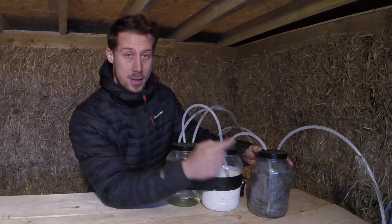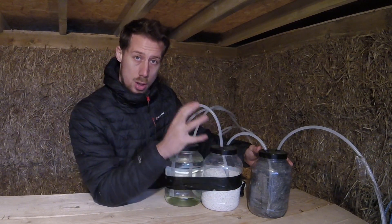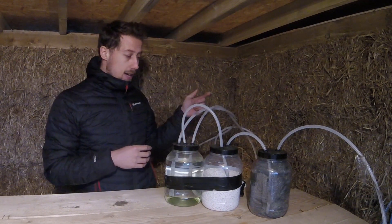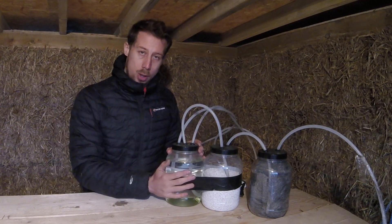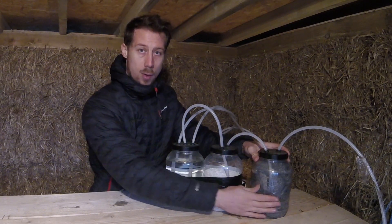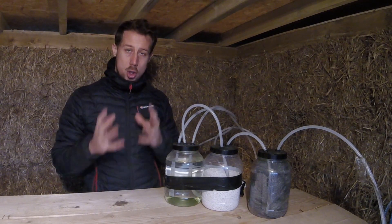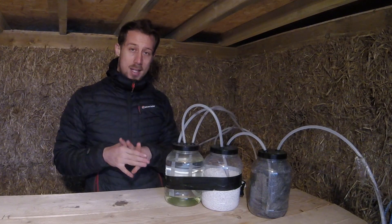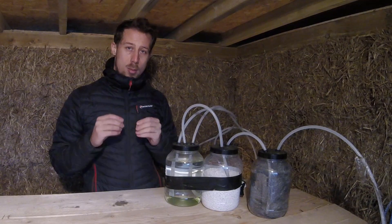And then lastly we have the wire wool or steel wool — that's what reacts with the hydrogen sulfide to remove it. So after the gas comes through these two stages removing the carbon dioxide, taking out any moisture, and then removing the hydrogen sulfide, the stuff that comes out and goes to the storage tank should be purified methane. Now it won't be a hundred percent — it's more likely to be close to 80 or 90% — but that will get you a nice blue flame.